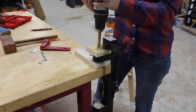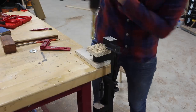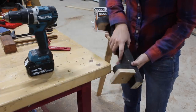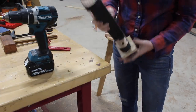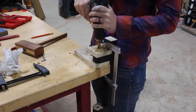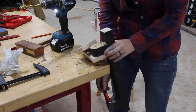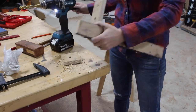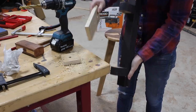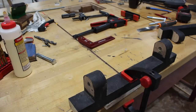Now it was time to drill holes for all of the hardware going into this thing. I'll be using a piece of all-thread at the pivot points so I started by drilling those holes. The important thing is that these holes are in line with one another, so I used a simple wooden block as a drill guide. I do recommend drilling these at a drill press, but mine was giving me issues so I did these by hand.